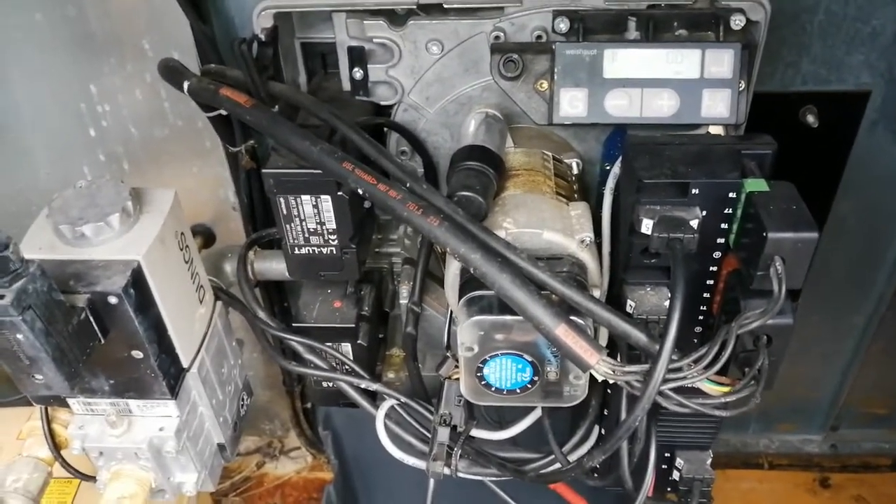I hope that has helped you. As you can see, this unit is on now and operating. It didn't start up straight away — the ionization, the flame wasn't recognized when I started it up. But I think that's because I'd removed the gas valve and it just needed a purge.